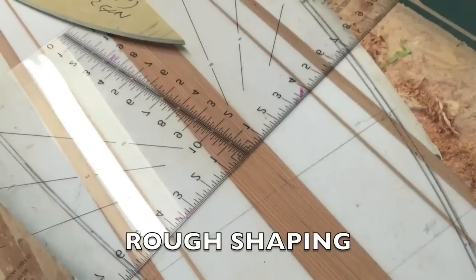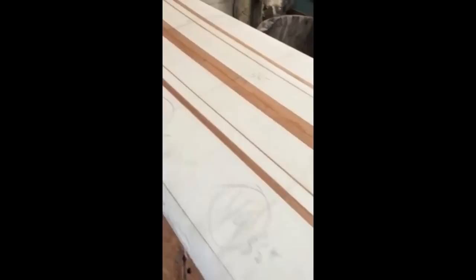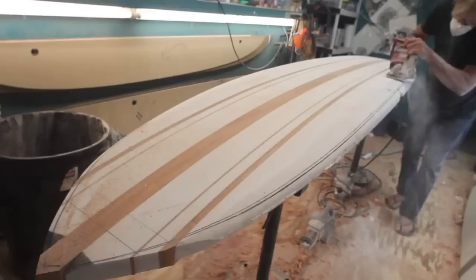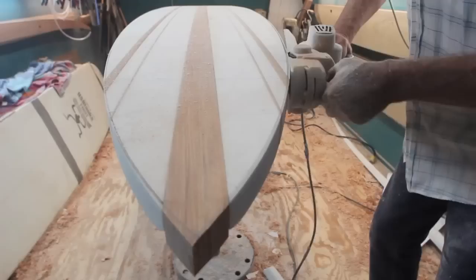At this point, I measure and mark up the blank, noting and circling the differences between the blank and the finished board. I study this for a few minutes so I know where I'm headed before I skin the blank. Then I template and cut it out with a skill saw. I keep the saw plumb so I don't transfer any changes up to the deck.